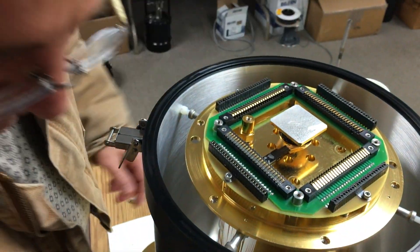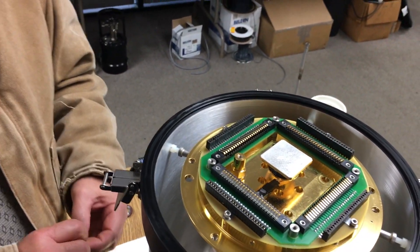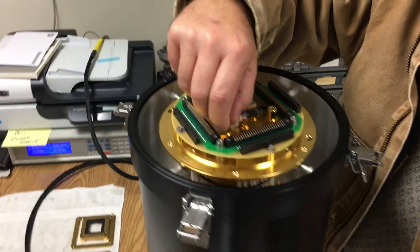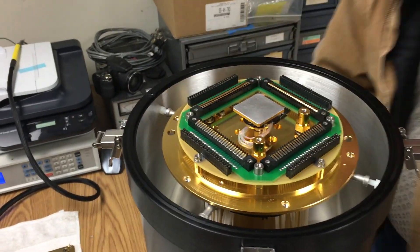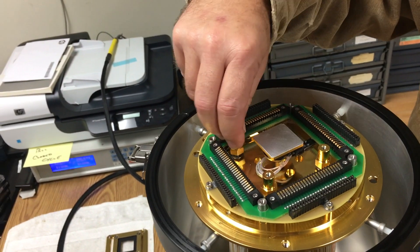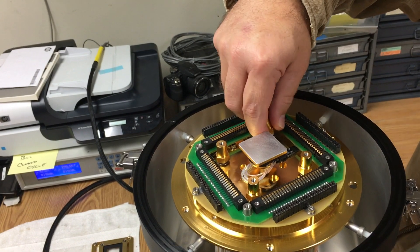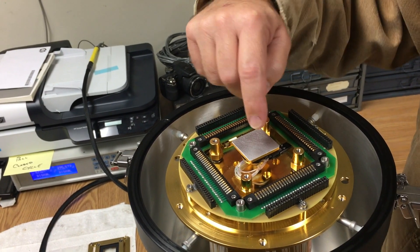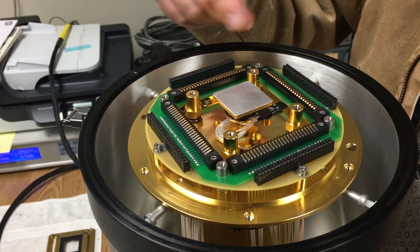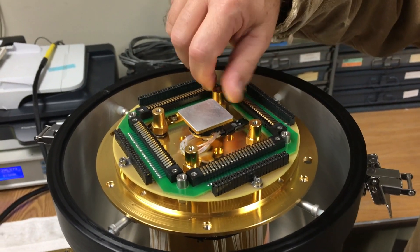For real production, yes, your hands should be gloved. When you guys are doing your testing you'll glove your hands. I still need to clean this thing up. On this pedestal I epoxy indium to it so you get a better interface, and then I use a release agent that has Teflon in it — spray it on there so it doesn't stick to the bottom of your carrier.